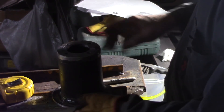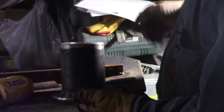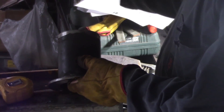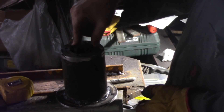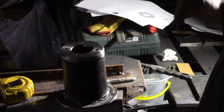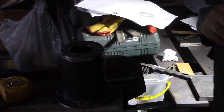I also drilled the holes — nothing much to it. While I had the part in the lathe I used one of the tools to put a shallow score mark around through the center of the holes on each end, and then all I had to do was make sure that I kept the holes 90 degrees apart and they would be a perfect fit. The holes in the big ring mount it onto the engine and the holes in the smaller ring mount the hydraulic pump onto it. I also neatened up the center hole while I had it in the lathe. If you haven't got a lathe, I'm sure you could do just as well with a grinder and a little bit of patience, measuring up your holes with a ruler and possibly a square.